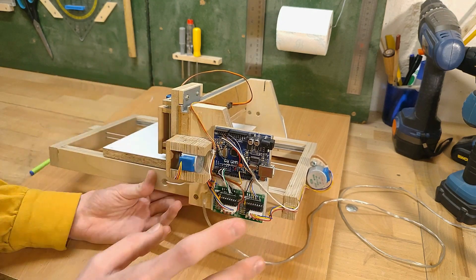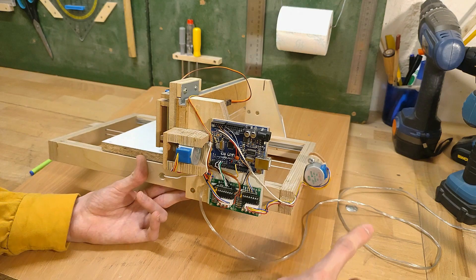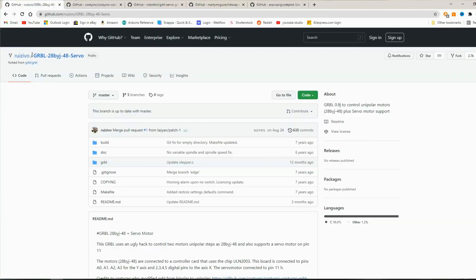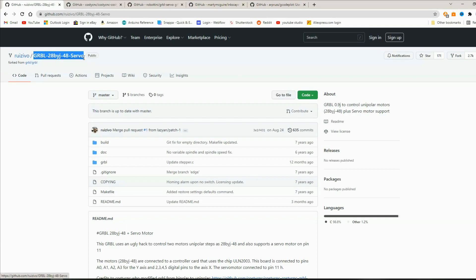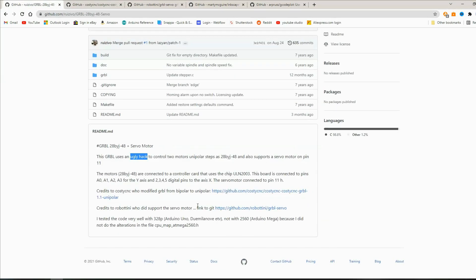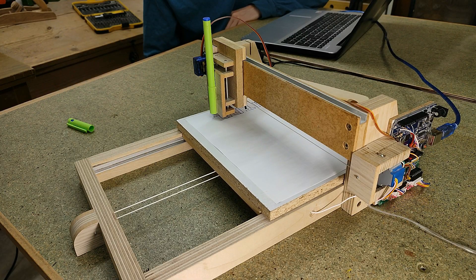Let's move on to the electronics. Electronic-wise, there really isn't all that much going on here. We've only got an Arduino Uno clone and a ULN2003 stepper motor driver for each stepper motor respectively, plus one limit switch per axis, because the real magic is all done within the software. In fact, to make a CNC work at all with unipolar stepper motors instead of the traditional bipolar ones, the Arduino needs to be flashed with a slightly modified version of GRBL in order to send commands the motor controller can actually execute. If you don't know what GRBL is, it's pretty much the standard firmware for Arduino-based CNCs. The specific version needed was modified by three very nice guys quite a few years ago and published on their GitHub pages. It uses a so-called 'ugly hack' to make the Arduino cycle through the required steps directly, which eliminates the need for more sophisticated motor controllers. On pin 11, which was originally used for controlling the spindle RPM, we've now got control of the servo used to raise and lower the pen.